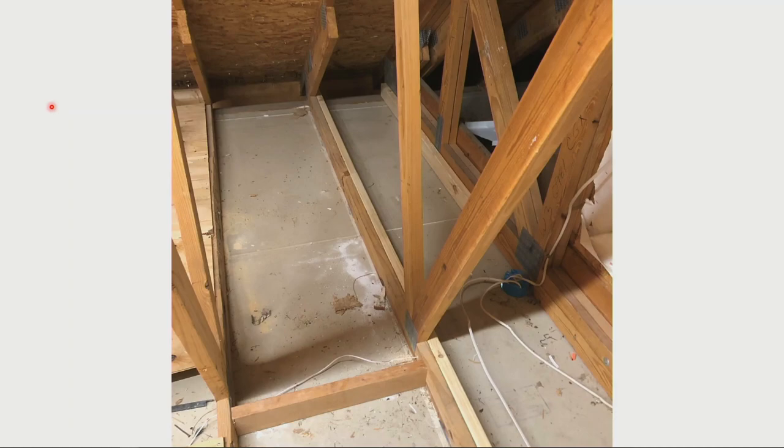One of the first things that I started doing was sistering together the 2x4s. So I'd add a 2x4 to every joist to give us a little bit more stability up there. I know it's not necessarily engineered, so as far as comments, please keep those to yourself. It just worked for us as far as the engineering aspect of it. We went ahead and I glued using some industrial glue, and used some lag bolts to sister these joints together.